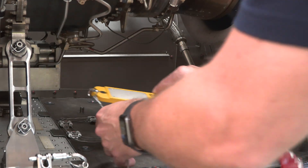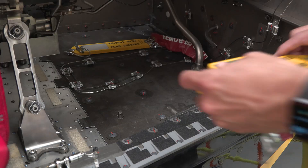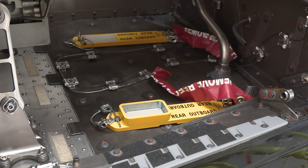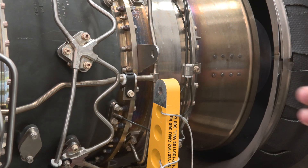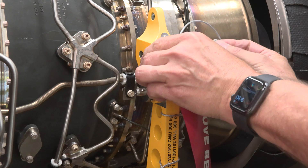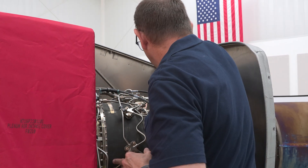The two rear guide plates may be installed on the engine deck. We will install the inboard plate first and then the outboard plate. Now we can install the rear foot assemblies to the engine using the lower ball pins. We will continue by installing the interface of the lifting device assembly to the top of each rear foot assembly and the engine using the two setting nuts and the two ball pins per assembly.